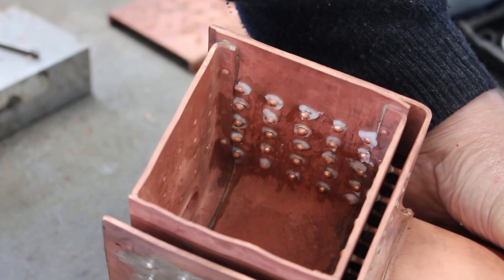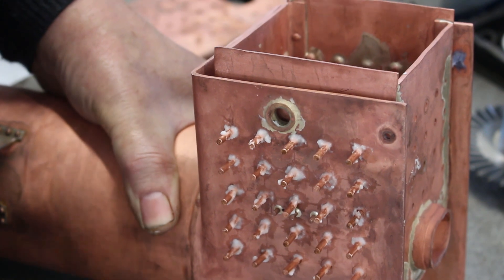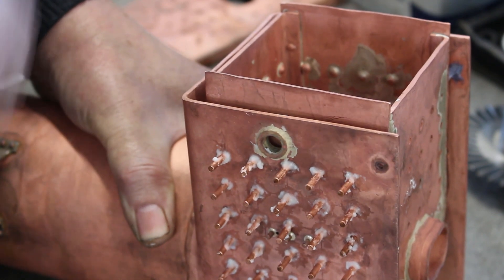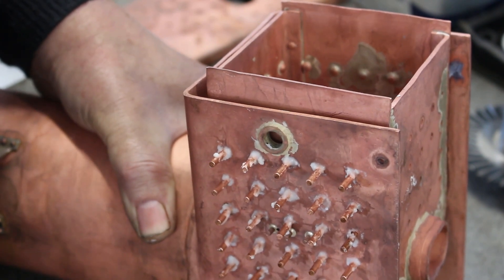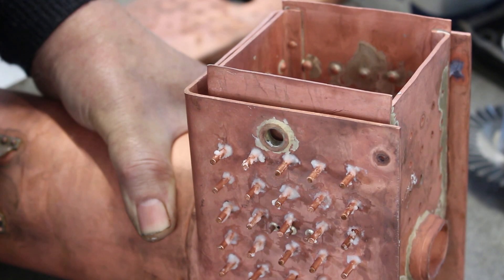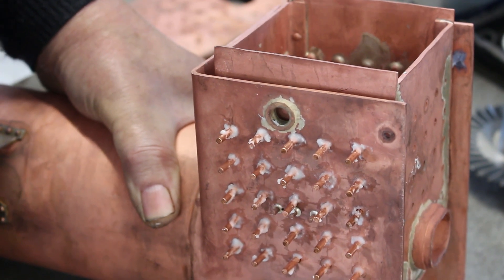All the rivets are installed now, ready for silver soldering. This side is where we're going to apply heat — this side is going to get pretty hot, and heat's going to travel along those rivets or stays very quickly. As the heat comes from the inside, if that flux does melt it's going to be drawn towards the heat and capillary action is going to pull it through the hole in which the stay is inserted. So hopefully it will keep it clean, or clean it a little bit more. I don't think it can do any harm.